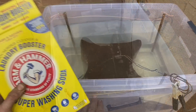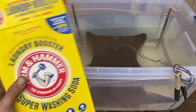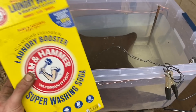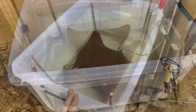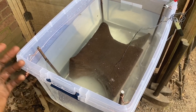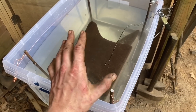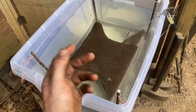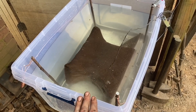Important note: this isn't just water in here — it's water with washing soda mixed in. You can use baking soda too, but you need about one tablespoon per gallon of water. There's about 15 gallons in there so I put about 15 tablespoons in. Safety concerns: whenever this is plugged in there's electrical current flowing through all the metal bits and the water, so don't touch any of it while it's on. Also, the chemical reaction produces pure hydrogen and pure oxygen — both combustible gases — so do this in a well-ventilated area away from sparks or open flames.